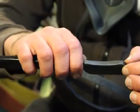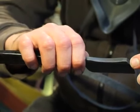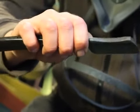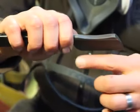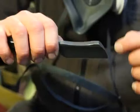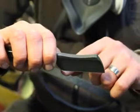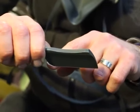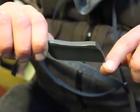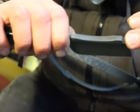When I do this, the sanding belt will make a noise, and the pitch of the noise will rise as the wheel moves towards the edge, because the edge is much thinner. So by the sound of the belt, I can hear where I'm at, and I will always grind right up to the edge. As I do this, the edge will start to foil, and if the edge is foiled from the heel to the toe, I know that when the foil is gone, there will be a perfect edge underneath.